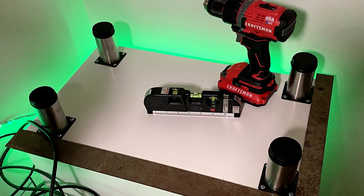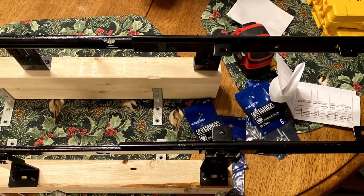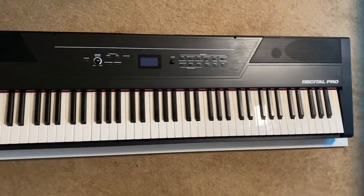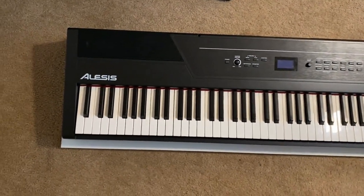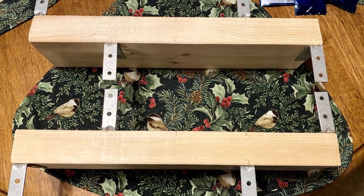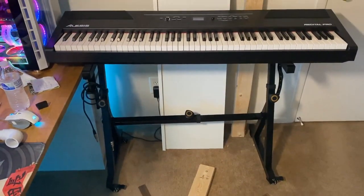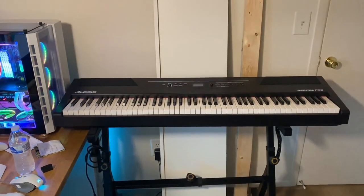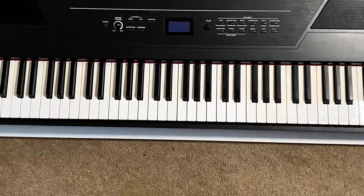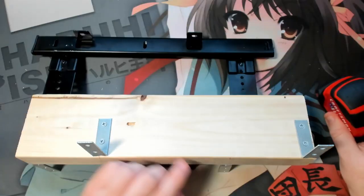You'll want to cut the shelf down to the size you want. You're going to need a drill to get those screws in, and you may or may not need a square tool. Keep in mind that with shelves this big, your shelf is really only as strong as the shelf material itself. I wouldn't recommend anything less than a half inch thick — at minimum a half inch, and if you're going as wide as I am, three-quarter inch to even an inch thick would be better for additional support.